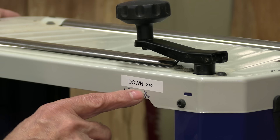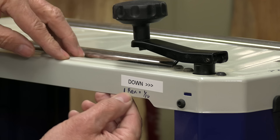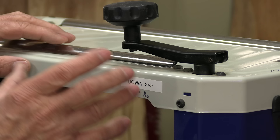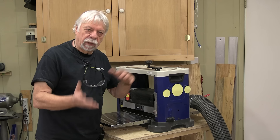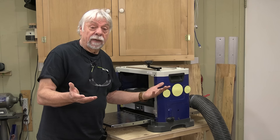You'll notice I've got some writing on my machine — there's a little sign that says 'down' so I know exactly which way to turn the crank when I'm in the middle of processing wood without having to think about it. It also says one revolution equals a sixteenth of an inch, so I know the exact depth. Never be embarrassed to mark your machinery with little notes like that. That concludes my video on planers. A number of you are wondering about the difference between a planer and a jointer — I get that question a lot. My simple answer is to get a jointer first, but I've posted a video over here with more information on jointers. I'm Colin Kinnett for WoodworkWeb, thanks for watching.